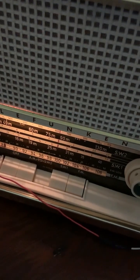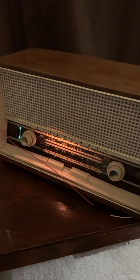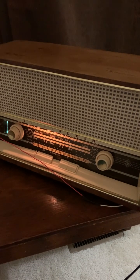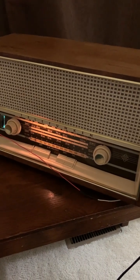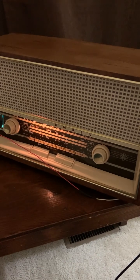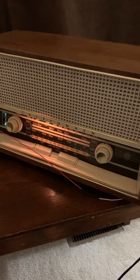So, remarkably stable internal BFO, based on the Hartley design, the simple one megaohm feedback resistor. It draws so little current, and with just a very loose coupling to the antenna through a couple little loops of the output of the BFO, and we're good to go. Excellent system.